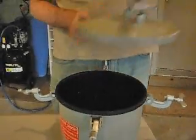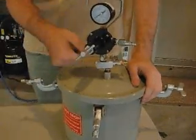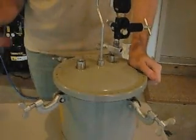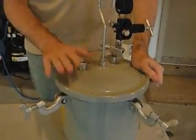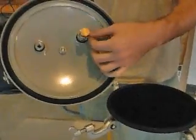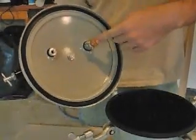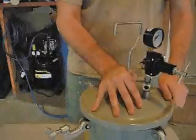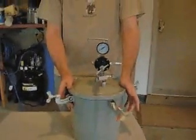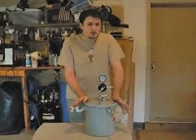The difference is that this pot was originally intended for painting — you'd put paint inside, force air in, and it would force the paint out to a spray gun or atomizer. What we've done is bolted that outlet shut with a bolt and a bit of Teflon tape, really tight. The pressure when applied pushes in, so this effectively is a pressurized chamber. This was probably about $40 from Harbor Freight. It will go up to 60 psi, which is about what you need for pressure casting work.